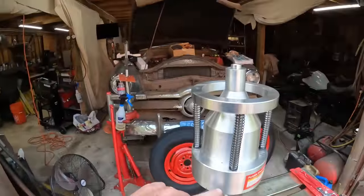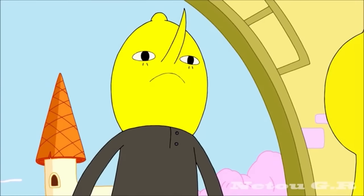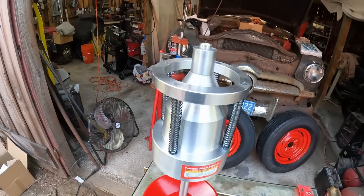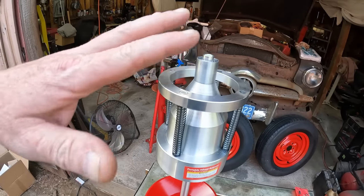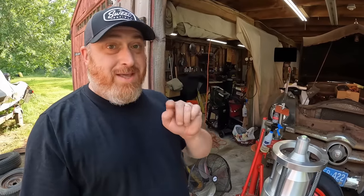Right out of the box it moves okay, but that should not stop like this — that's an unacceptable condition. This should not stop moving like that; it should continue to walk itself around and eventually stop. The problem with every bubble balancer is overcoming friction. The pin sits in a hole and it's supposed to balance itself on basically the tip of a pin. I'm going to show you why this doesn't work and then how to fix it.